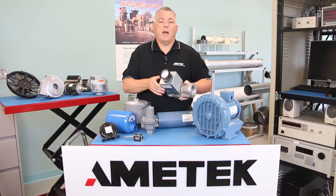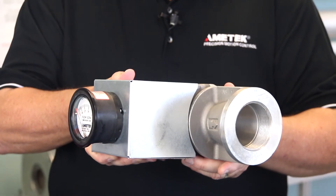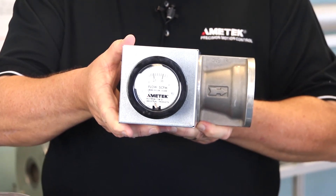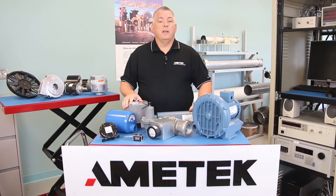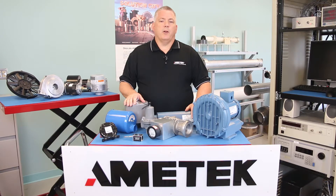Flow meters can optimize efficiency by measuring the correct airflow. When evacuating CFM from more than one pipe, different run lengths or end system impedance can cause one pipe to handle more CFMs than another. With an accurate CFM reading, piping can be balanced by bleeding air in or out or by creating extra impedance. For systems in which channeling or plugging can occur, a change in the CFM measured can identify unseen changes in your system.